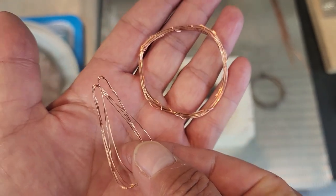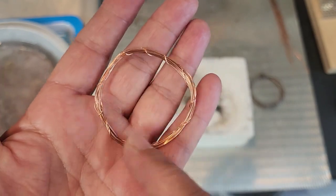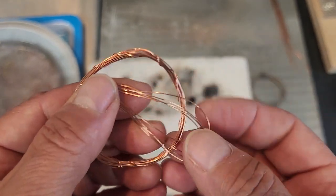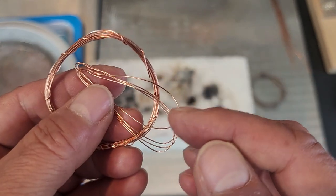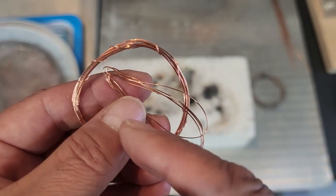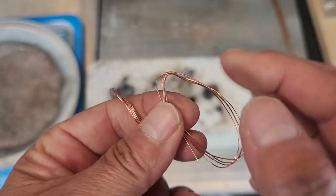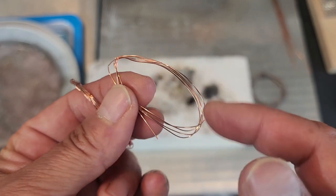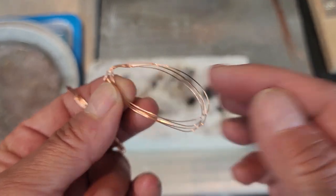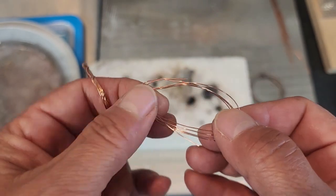For thin wire, it's quite important that you bundle it up so you get a nice even temperature. Mostly I anneal the bigger wires, but it's the same principle. With 18 gauge, what might happen is that straggling wire out here may heat differently than wire that's tighter together — you'd have uneven heating, meaning some of it might be softer than others, some might have gone brittle, and some might not have even reached annealing temperature.